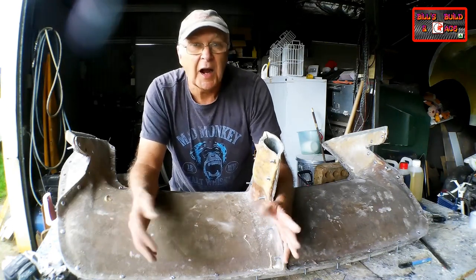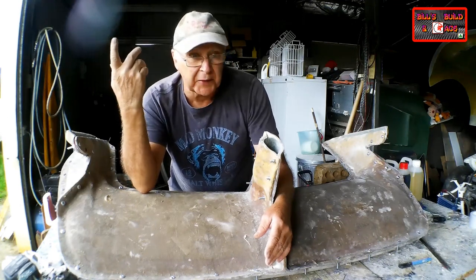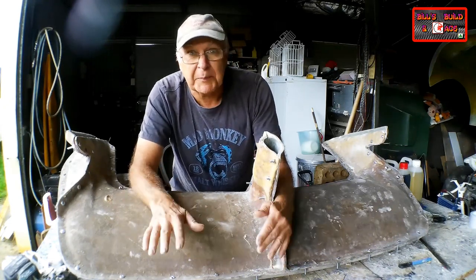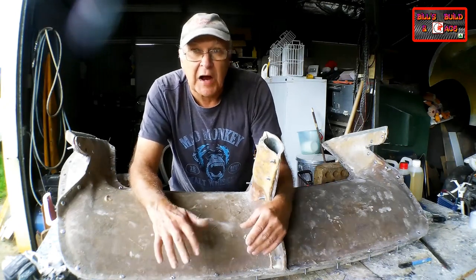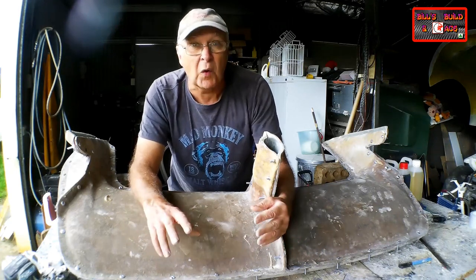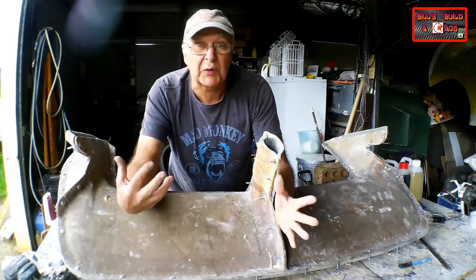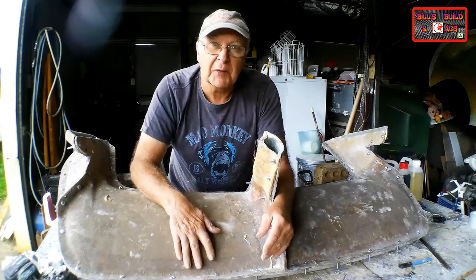It's been a 30 degree day today, and I've been waiting, and I don't know whether you can hear the rain on the roof. There's a bit of thunder around. But I've been waiting for the temperature to drop, which it has now. If you are pouring foam and it was over 30 degrees in your area, I would wait and do it late in the day or last thing at night or first thing in the morning. Don't do it when it's hot, it'll just go off too quickly. Got to mix some up, pour it in, and we'll get this job done.